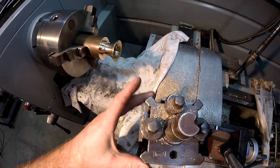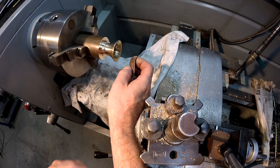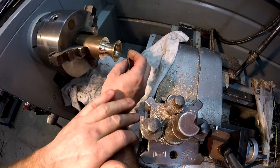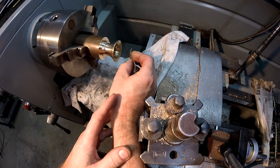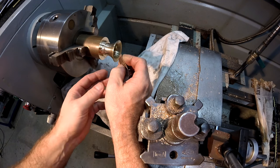So what I do is I bring the tool post in, and if I'm polishing like this, obviously you can see this is well clear, but if I'm polishing like this, I put that against the back and I just move my wrist. That way, if you slip off, you've only got maybe 1 inch of travel,